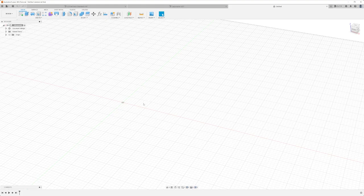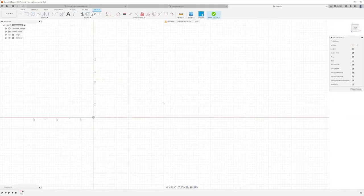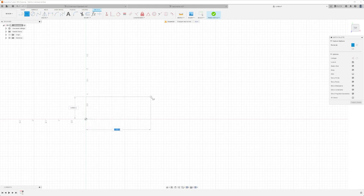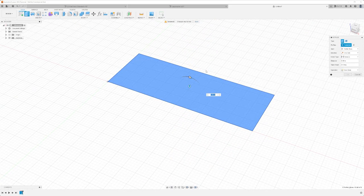On each one, when we do the CAM settings, we'll adjust the feed rate, depth of cut, and so on — to see at what point these bits start suffering. A guitar fretboard towards the heel is somewhere around two and a quarter inches, so we'll go with that for the fret length. Then let's do about six inches, and then we'll extrude this up.